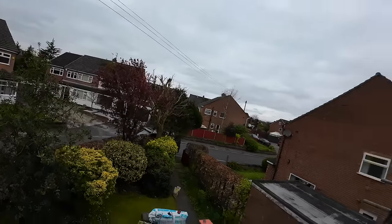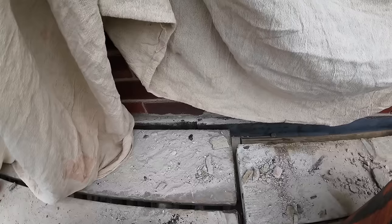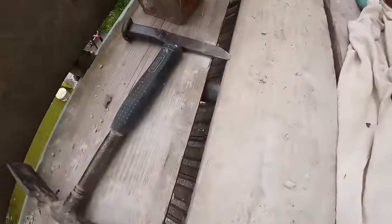Okay. Update for the last 40 minutes. I've been bombing around in the van, as I always seem to do. But good reason for it. When we took out the joint there, that's the maximum we could go, the lowest we could go, obviously, because of the scaffold. And with the lead being there, if we'd have put the strong boy in there upside down, I'd have been tripping on the strong boy, and the strong boy would have actually sat on our scaffold. And we can't afford to transfer this weight onto the scaffold because the scaffold sat on the roof below, which is concrete tiles. So we need to keep all the weight off that as possible.